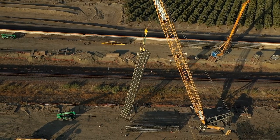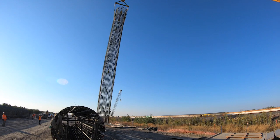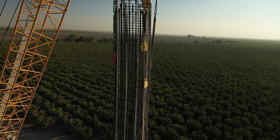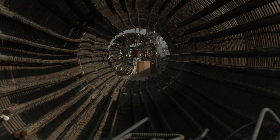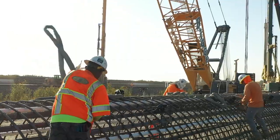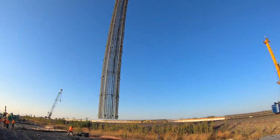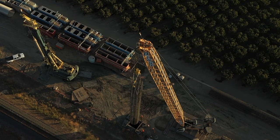Right after we finish the squid test, our cage crew comes in and picks the bottom cage, trips it, and stands it up vertical. The heaviest cage we had to pick was about 170,000 pounds. The cages for the 10 and 11 foot diameter piles have triple-bundled number 18 rebar in the top 60 feet of them, so they're super heavy. A lot of care and planning goes into everything we do here.